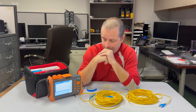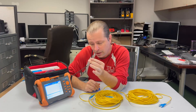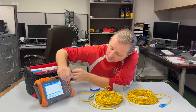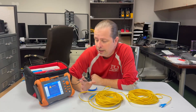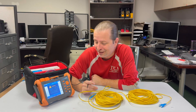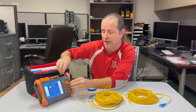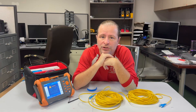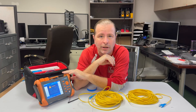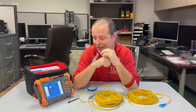I'll add a launch and a tail in order to get a little bit more resolution on my graph — it gives me something to show to the higher-ups or the end users to prove that the cable is good. This particular item from Amazon is a touch screen, comes with a stylus, and seems to run some sort of version of Android. It can connect to your PC and download the charts, however all the software I found is in Chinese so I don't use it a whole lot. If you really want to be serious and certify it, you need to go get something like a Fluke Versiv, a DSX, or a Lantech — this particular product is just a tool for you, the cabling guy or the computer guy turned cabling guy.